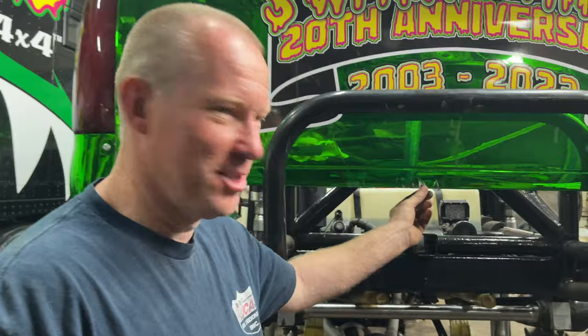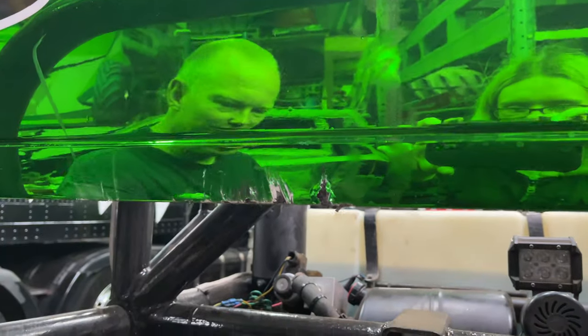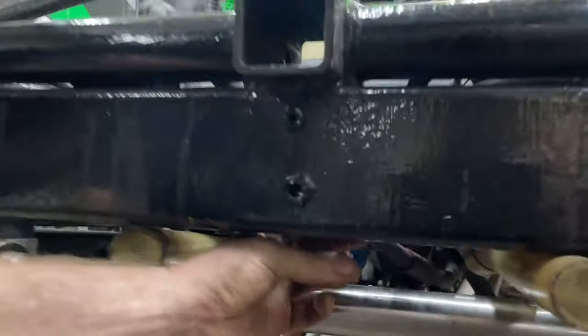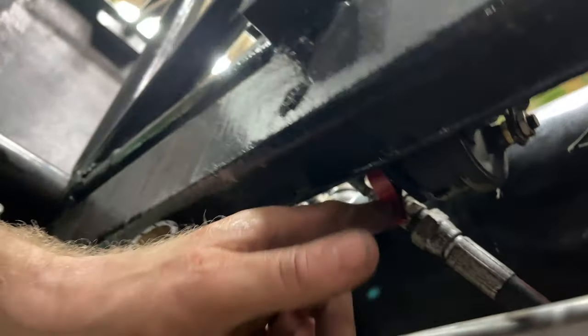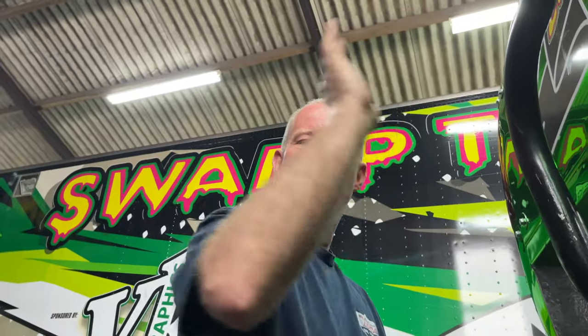Let's talk about the problem we had on the very last jump at the Devon Truck Show. We did a really nice jump, real rig, high sky wheelie. Unfortunately, you can see by the damage here, we caught the truck on the last car, and it shut off this little switch under here. That turns the power on and off to the truck, but it also broke the hydraulic line there, and that let the steering turn at the back when we were doing a jump.